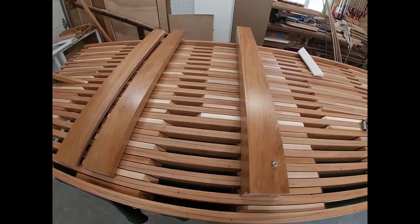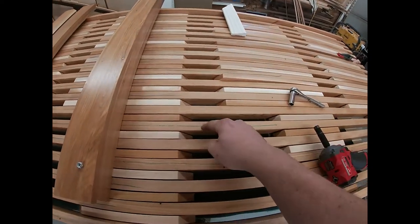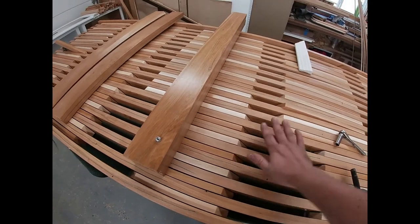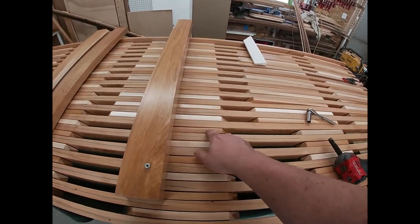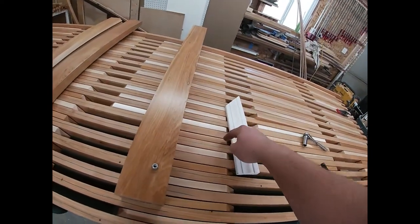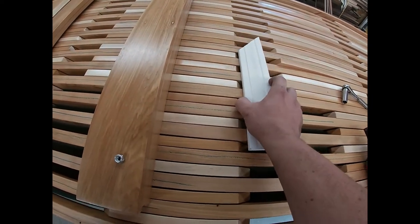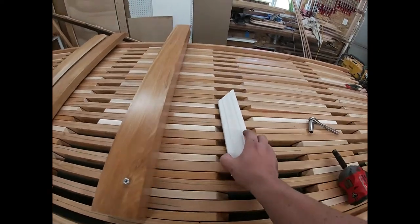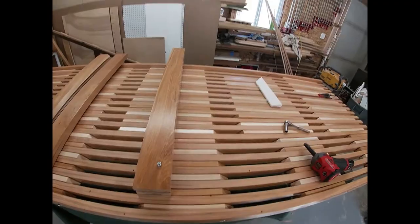After I cut them to size, I'm going to have a lot of drilling because these boards are going to get screwed into every one of these full length pieces to add strength to it so it doesn't bend as much, and also it will stop these from kicking the board out and lifting. So if it's not screwed in here and this tine right here is folded down, it can cause it to lift a little right there or flex. So better safe than sorry, just put one screw in every single board. Alrighty, so I'm going to go through and do that.